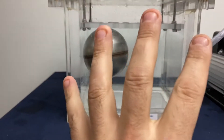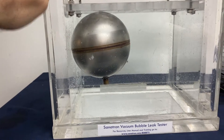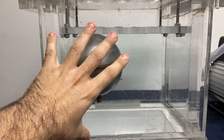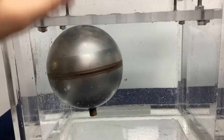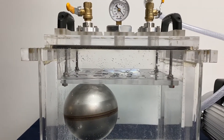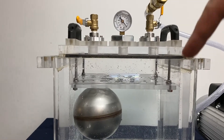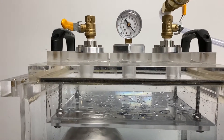At this point we have an acrylic vacuum chamber filled with water. We have a spacer here — this is a package restraining mesh. Generally it's actually connected to this lid, but this lid doesn't have the threads, so we just have a free floating spacer. We have a vacuum pump right here and the valves. We have already adjusted the vacuum to be at about 16 or 17 inches of mercury, so when I turn on the vacuum pump you're going to notice this vacuum gauge going right to 16 or 17 inches of mercury.